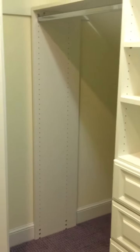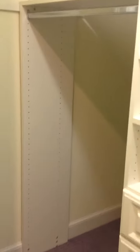What we have is three-quarter-inch white pre-finished laminate. There was a cleat on the side wall — this is a unique situation because the cabinet is not going up against the back wall. We have the cabinet in the center back for stiffness, and we reused the cleat on the side for support and screwed the cabinet in at both the bottom and top of the vertical to keep it from tilting forward.